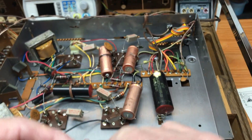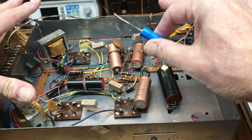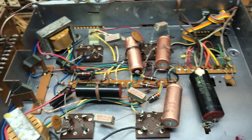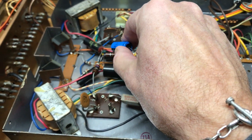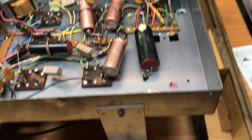What I do, especially on a new unit I'm not familiar with, is take photographs. Take a nice big photograph with your iPhone or Android phone — take some individual ones — and you'll always be able to see which way everything is going and you're not going to get into trouble. As you can see, plus is right there on this side, plus is up here with that little ridge, and negative has no insulation.